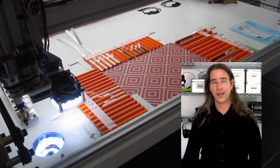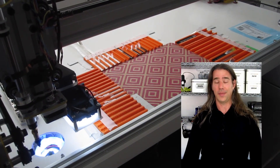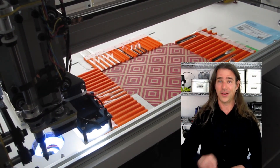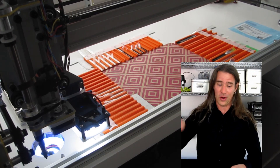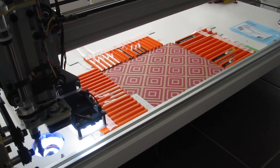With that out of the way, before any boards are pasted up and the timer is started, I like to do all my pre-flight checks. First thing is powering up and homing the machine. Though this barely ever happens because I use these nice little printed dots to do the homing mark, I start up the machine, power it up, home it. Mistake number two: failure to keep the work surface pristine. After wiping away the dust, homing went smoothly as usual.